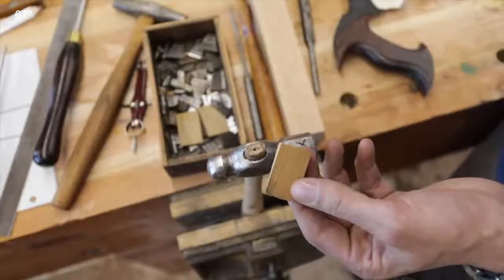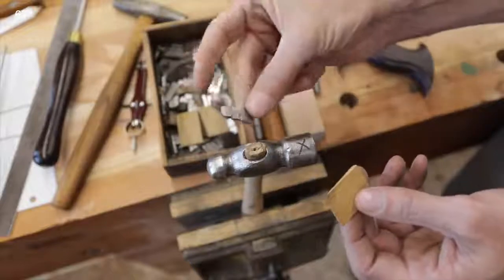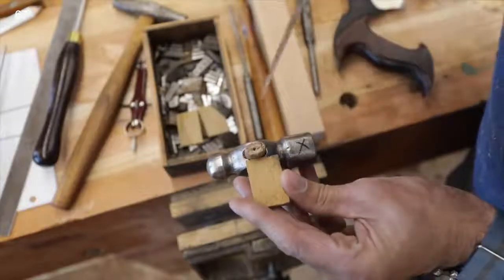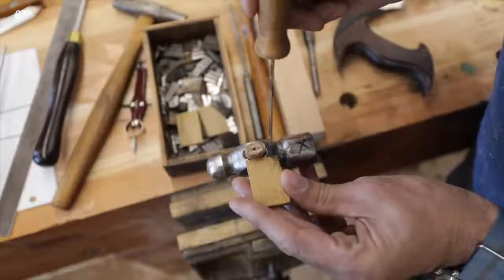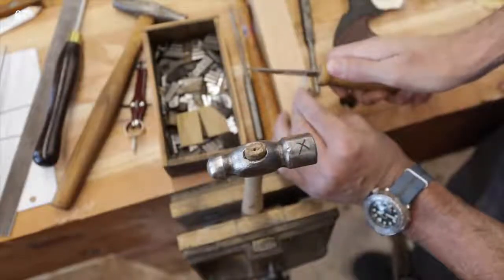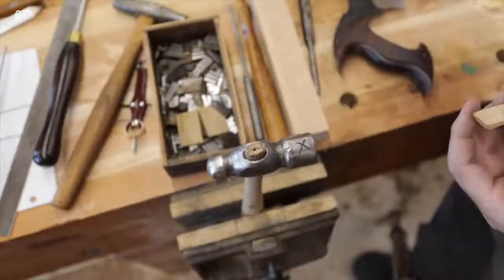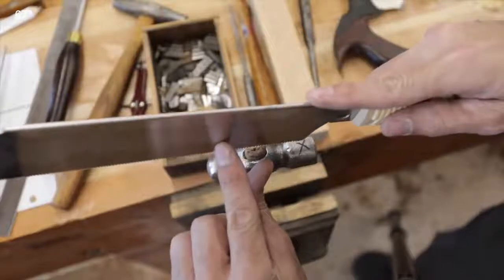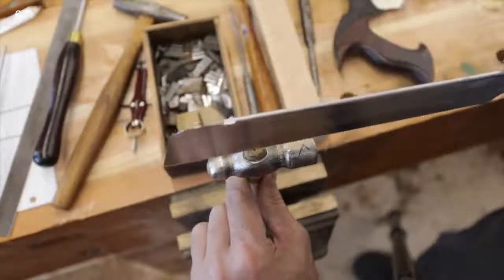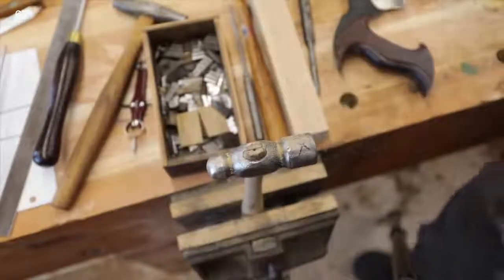You can buy wedges or make your own — a lot of guys use pine, I typically use whatever I have; it doesn't seem to make much difference as long as it's dry. Sometimes when you buy a wedge kit one comes included; if it's the wrong shape it's not a big deal. I like it to be a little bit wider than the hole, so you can trim it down. Wedges should be made of really straight-grained wood so they split cleanly. The fit I've got is so tight I can barely feel the kerf.